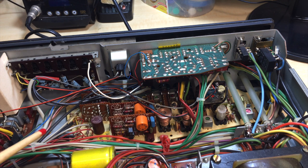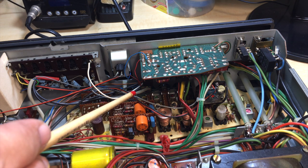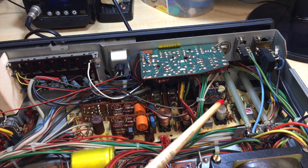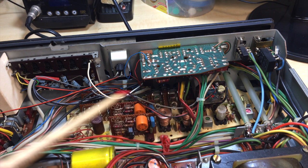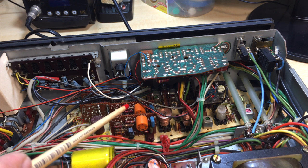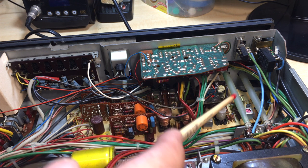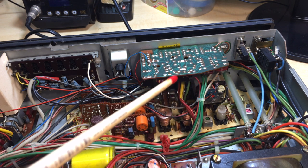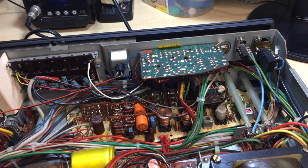We've obviously got the power supply and amplifier over here. There are quite a few little satellite boards plugged in here. The tone controls are over there. This will be the IF section, and there'll be some RF over here. This is making a heck of a lot of noise — something's scraping in here. These are the presets. Until I get into the schematic and start looking at more details I'm not sure what some of these things are, which is fine. There are a hell of a lot of capacitors to change over here and quite a bit of wiring. All these capacitors are going to have to go — definitely these electrolytics. Some of the wiring is loomed, some of it flies around everywhere. All the switching happens down there. I'm thinking this is the condenser here — I think that's the condenser. I'm not sure how the FM is tuned; it could be varactor tuning. But we'll get there.